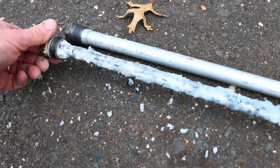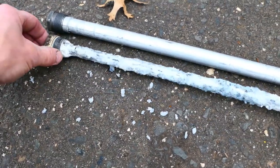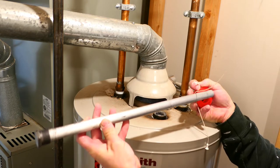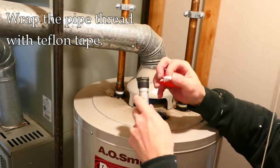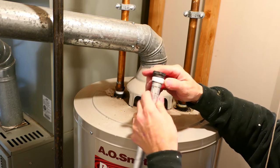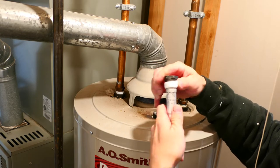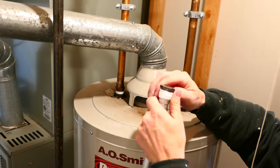This old one is just about done. I'm going to do some more flushing because there's clearly more sediment from all this, and we'll flush it out as best we can. Then we'll put it back together. I did a little flushing and got that out of the way. Now we'll put the new rod in. You do need to wrap the threads with Teflon tape — get a few winds around there and make sure it's sealed well.